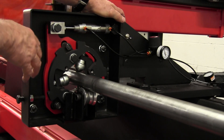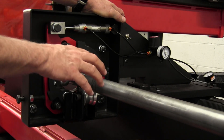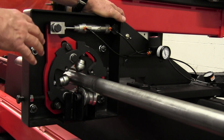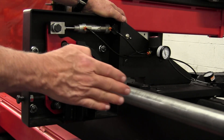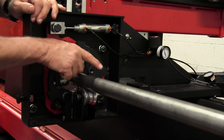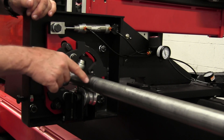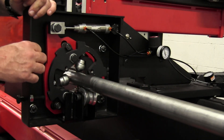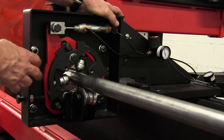Transfer balls work pretty well unless you're dragging them up and down the tubing the whole time. This machine rapids at 1,100 inches per minute, and we're not going to get any kind of life out of the balls at that speed. It also mars the tubing — there's no deep mark, it's just scratching the outside surface. If you painted it you might not see it, but it is putting lines in the tubing all up and down as you rapid, and of course you're wearing out the balls extremely quickly.